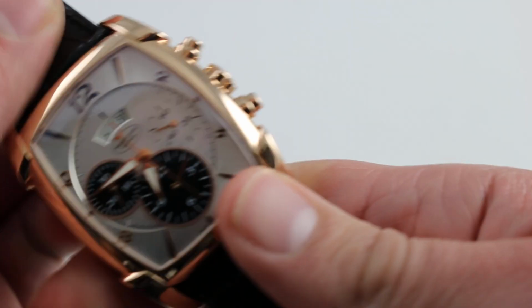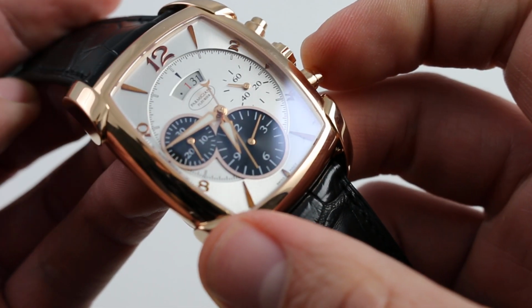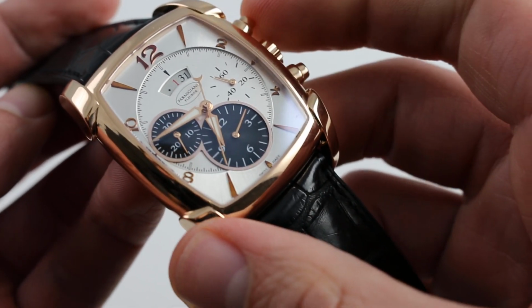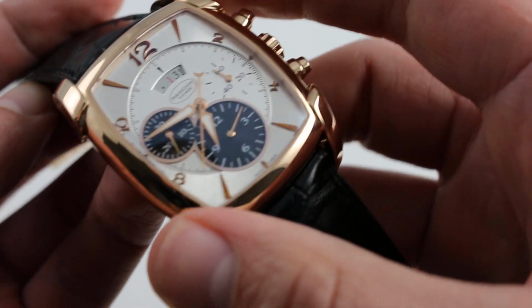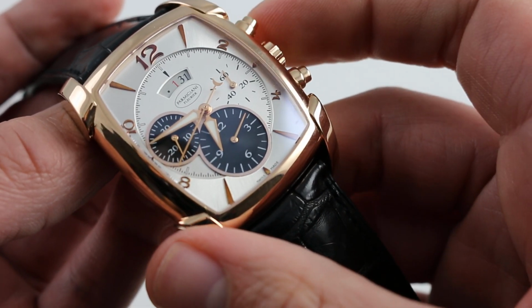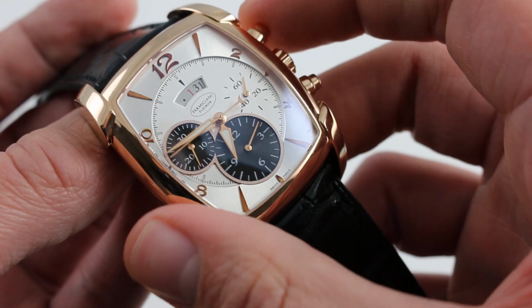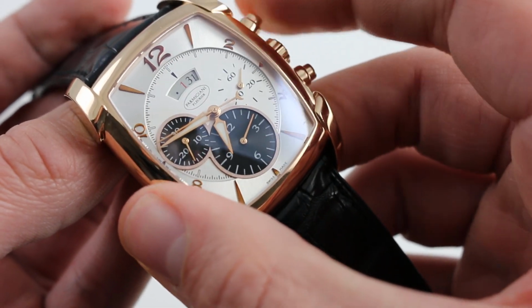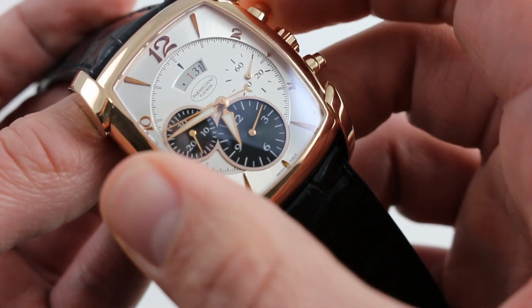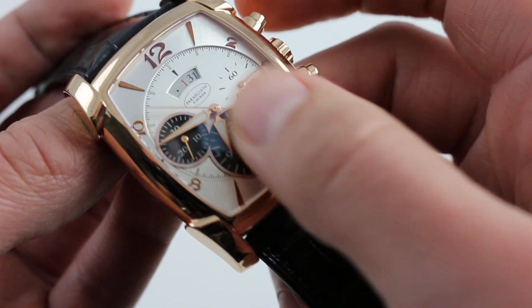Now the modular chronograph is a superb addition because it allows the base Vaucher 4000 caliber to maintain its above average 50-hour power reserve and its underlying efficiency thanks to unidirectional winding, ceramic rotor bearings, even torque distribution throughout the entire power reserve of the watch, and at the same time that module allows Parmigiani to use a refined vertical clutch engagement system to start and stop the chronograph.